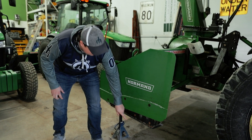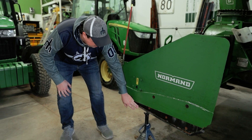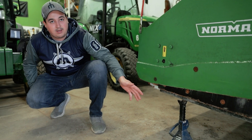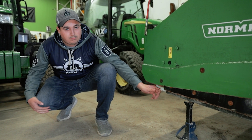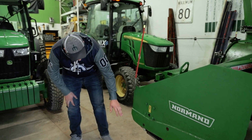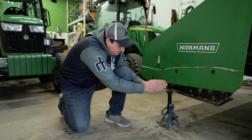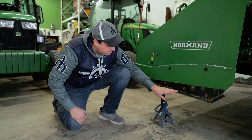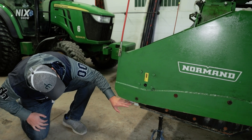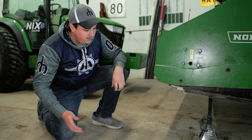This here is the rubber shoe, and that's to protect your laneways from the metal piece scraping it up. On the back here we have our plastic cutting edge, and that's for when you're dragging your snow — it also keeps your laneway from getting scratched. You have to keep an eye on both of these. You have your adjustment here and you can drop the shoe — we've made little strips in there so we can drop the rubber down once it gets worn to a certain point. Once the white cutting edge piece gets to about a half an inch thick, we take it off and put a whole brand new piece along the bottom to keep your laneway looking as good as new.